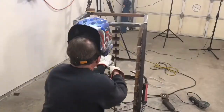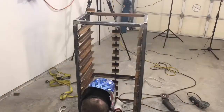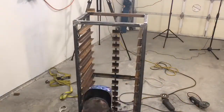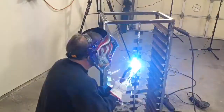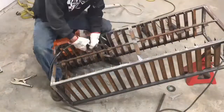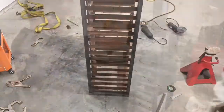What I'm using here is just a piece of angle iron. I clamp my little back braces on to it and then set it on the side angle irons so that everything kind of lines up — it worked much better than my old method. And then here I am just adding a second tack weld to each one of those back braces. With that done, it's basically ready to go to the powder coat.